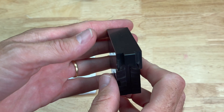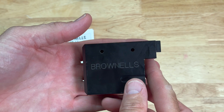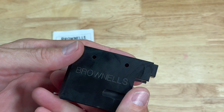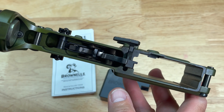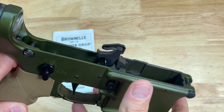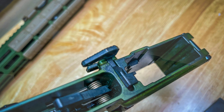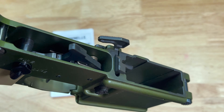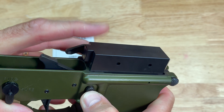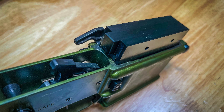It's engraved Brownells and made out of a Delrin material. If you look, it's got the magazine catch right there. So what this is used for is when you're dry firing your AR-15 lower assembly — this protects your lower receiver. Here I have a Brownells exclusive Geissele Super Duty. When you drop the hammer without something like this, you're going to be hitting this wall right here, and you risk cracking the receiver if you do that repeatedly. Something like this is very helpful because you can just drop it in like such, and you have a safe piece of material that will protect the wall of your lower receiver.